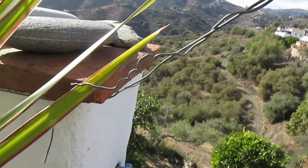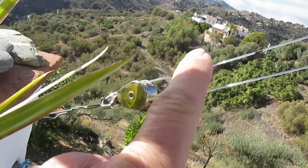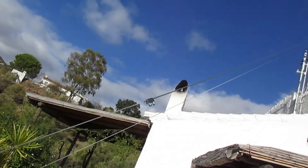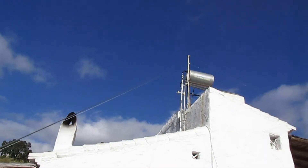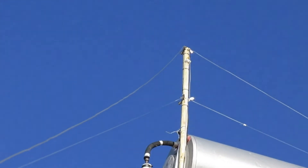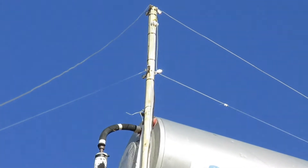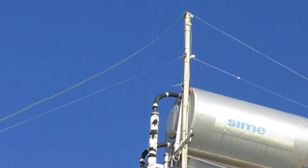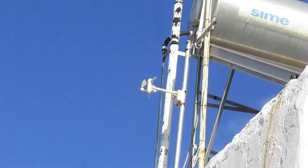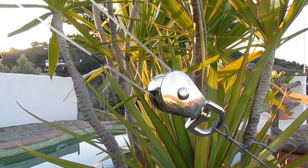Antenna's up. There's a piece of wire around this post, goes to the first pulley which is hanging onto the nylon fishing line that goes right up to the top where we've got the pole and the pulleys. The motors didn't work out very well — one of them broke and I didn't have a spare — so I can pull the strings by hand and move between the bands that way. At least that'll prove the idea, and I believe I do have string-pulling technology. To move between the bands easily I marked the fishing line at the various places where it was resonant on each of the bands.